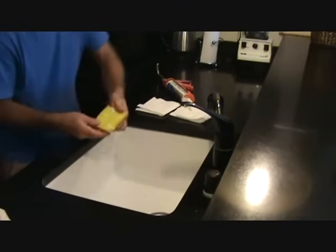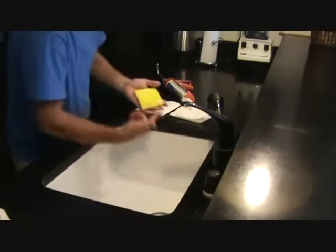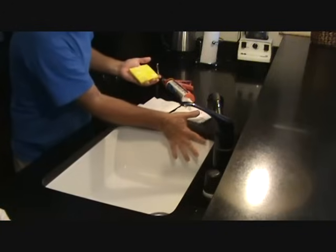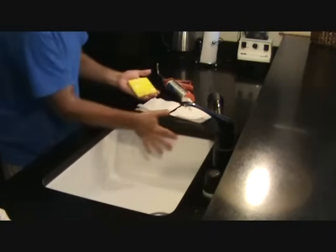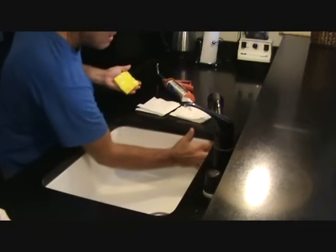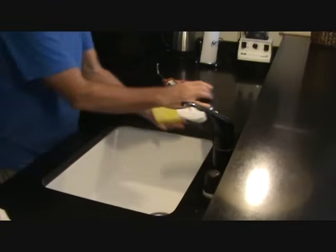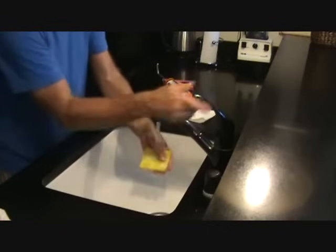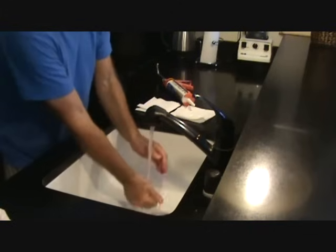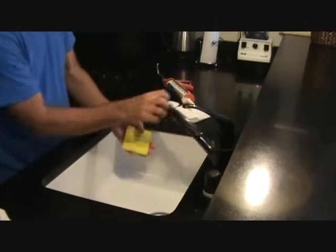You can backhand it and go that way, or use your other finger — keep it flat. If you feel any excess on the porcelain, just take your finger and wipe off the excess without going down as far. Then go back over it once more. Once you have caulk on your sponge, rinse it off carefully — just don't get water up high into your work area. Wipe off the excess on a paper towel so you don't have to rinse as much.